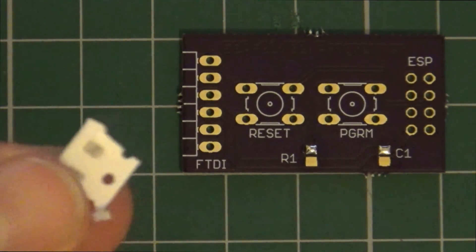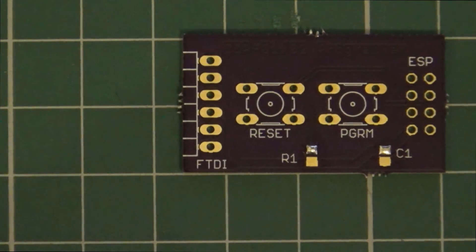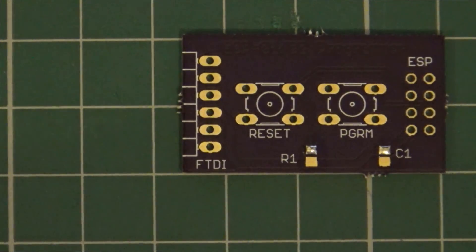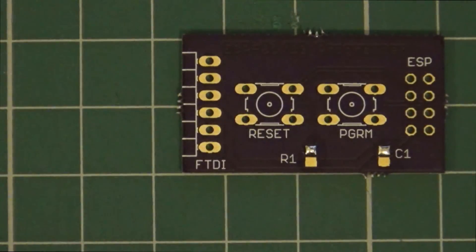They just come in these long strips. Two from a strip there. There are two capacitors — I'm going to do two boards but I'll obviously only video one. So I've trimmed two of these off. I'll pop this little guy out here and also the resistor. Now the capacitor has no markings on it, so you just gotta make sure you get the right one — don't mix them up.